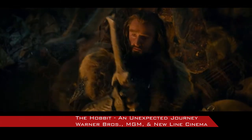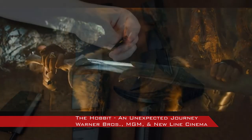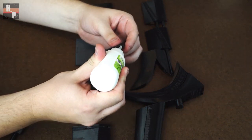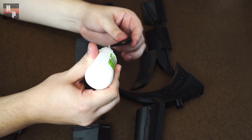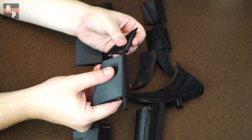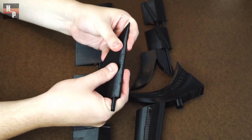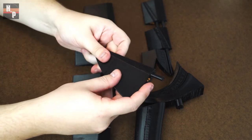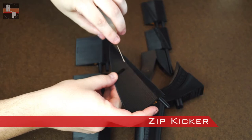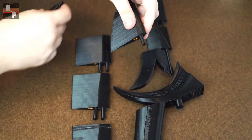I've included a link to the free files in the below description. These files were printed on my Ender-3 Pro. To attach the pieces I use CA glue on both the pieces and the supports. I have found CA glue to work really well in providing a secure bond on 3D prints. In order to cure the glue almost instantly, I use a drop of Zip Kicker. This allows me to assemble at a faster rate since I don't have to wait for the glue to dry naturally.